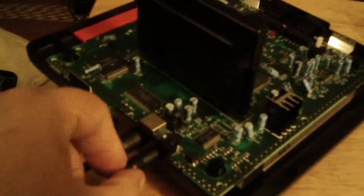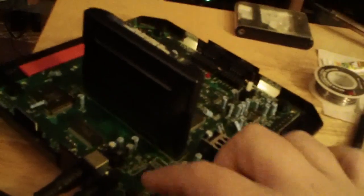Was loose. I don't know if it came loose just over time or whether it got dinged in the throwing or what. But if you jiggled the plug, it would work, but it would just sometimes cut out randomly. So what I did is I took the actual board. I'm not going to pull this one back apart, but I took the actual board out of there and then unsoldered that little piece